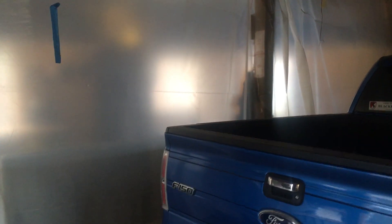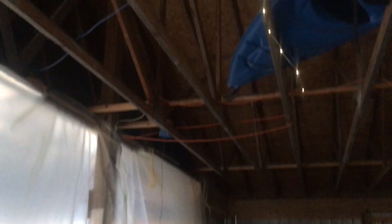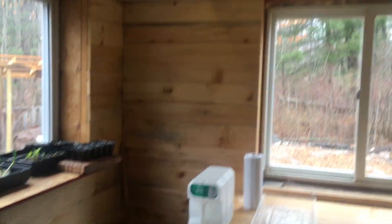This is a weird building — it's a 12-sided room. What I did is I sectioned off this area, and you'll see in a second that it's all built out, but right now still behind a visqueen wall and an uninsulated ceiling. That's coming for next heating season. But I was stoked to get the mass heater built, so we made this tongue and groove knotty pine — which it turns out involves many steps from rough-sawn board to tongue and groove. This area is really highly insulated: I've got R40 on the walls and just R10 on the roof ceiling so far.